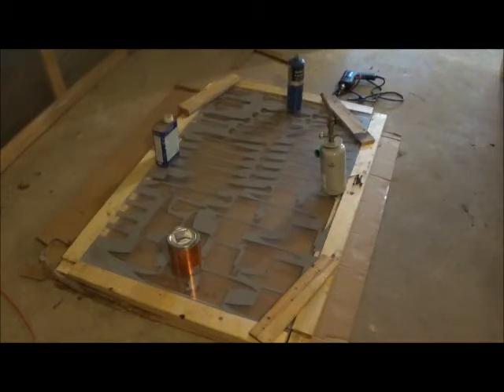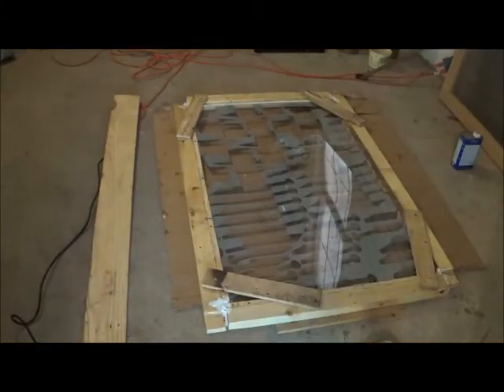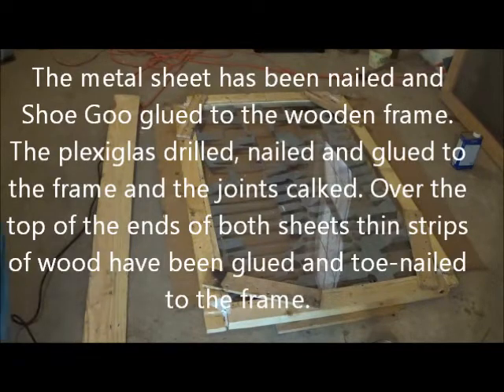You'll notice those scab plates on the corners. I'm going to screw those in and that'll give some stability while it's actually being mounted in the wall. In addition, I may put a plank on the other side. Turning this window over is going to test the strength of this frame and see if it's going to hold together at all. This is really a critical step.